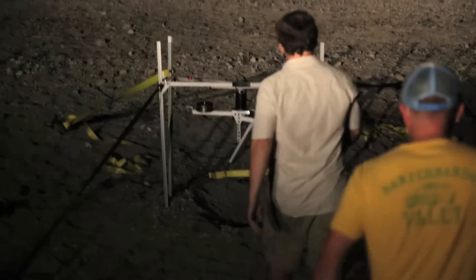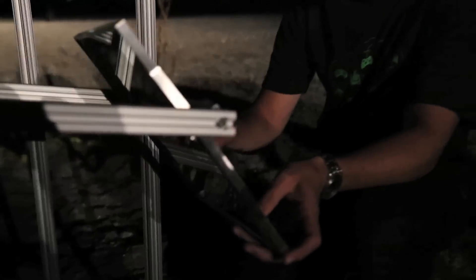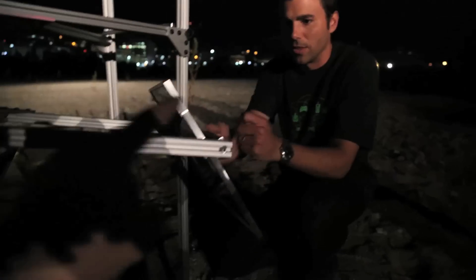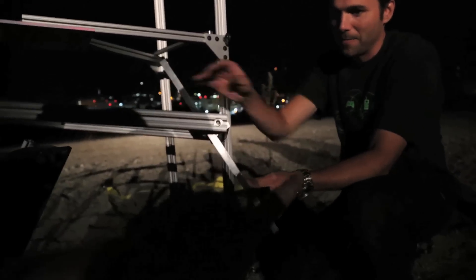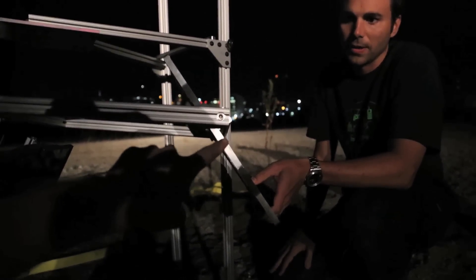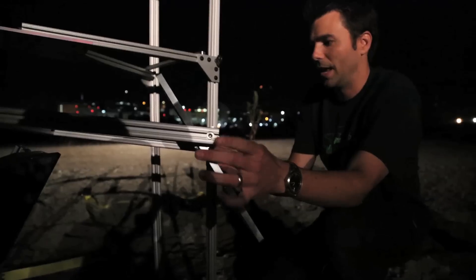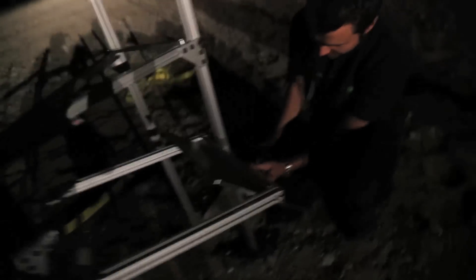I think we're... Is it rolling? I don't know if I was. Look at the camera — I think Mark wants to cry. What are you thinking right now, Mark? It's recoverable. You learned from your errors. I want to kill you. So basically, the center of mass on this mirror isn't lined up with the axis of where we have the bolts — it's a friction joint. There's an offset, sort of a moment, that was causing this to come out. The center of mass of this mirror is a few inches below the hinge point, and that creates a moment about that friction joint, and once you get to a certain rotational velocity it overcame that friction, and we contacted right here.